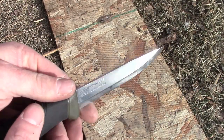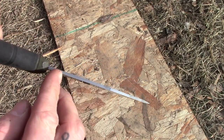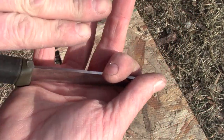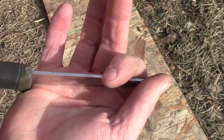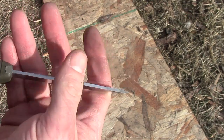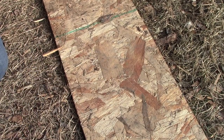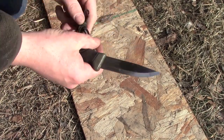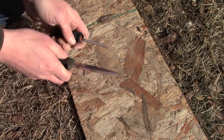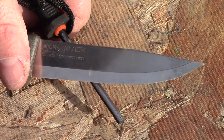Okay, so coming back outside — from right here to right here is where we have ground the blade, and now we have a concave on the top of this blade. We have one edge here and one edge here. This has a little more bite than a 90-degree spine. Let's jump right into a ferro rod and see if it indeed throws sparks better — oh, that's a huge improvement! Lots of good sparks there.